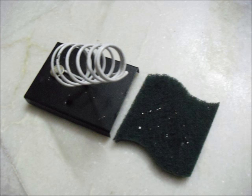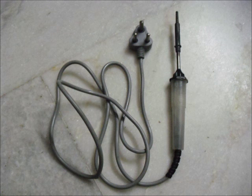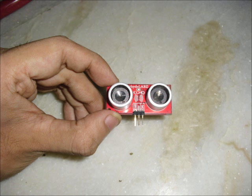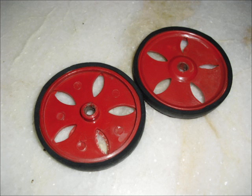The solder stand is optional but use it if you have one. Solder — I recommend you invest in a quality pack having flux core. Soldering iron; I've used a 30 watt one. An on-off toggle switch as shown in the figure. An ultrasonic distance sensor with PWM output. A standard USB cable for loading code into the Arduino chip, and plastic wheels for locomotion.